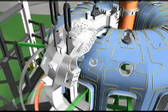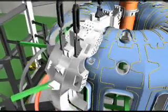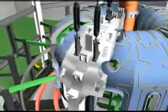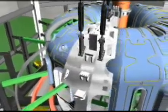While the TF magnet is rotating, the supporting beam and horizontal stabilizer sustaining the vacuum vessel repeats being disassembled in turn, and then reassembled again after the passage of the TF magnet.